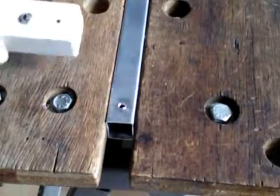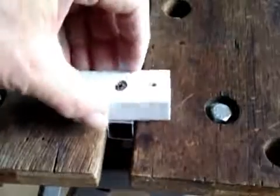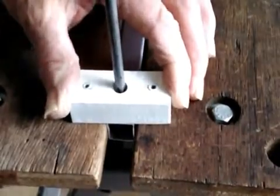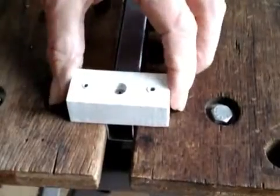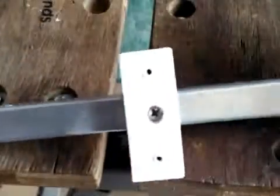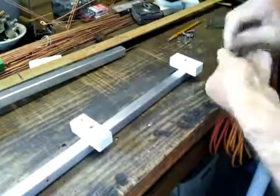Here's one I took apart to speed this up a bit. I start the screw and get it a little deeper so it sticks out and gives you something to grip. Put it on there, line it up, and now the fun part: don't use a drill for this — use your hands, use a good screwdriver. Don't go crazy with it, just make it tight. It's on, it's recessed, and it's a very nice piece. That's your insulator — there are three of them.